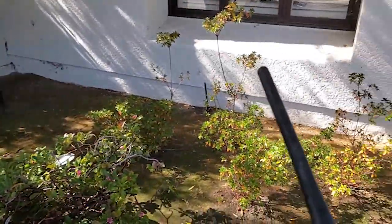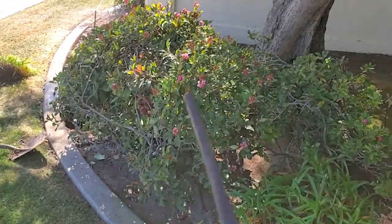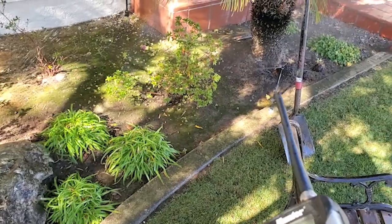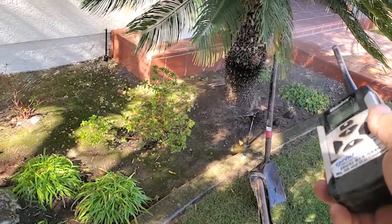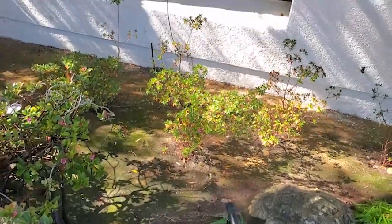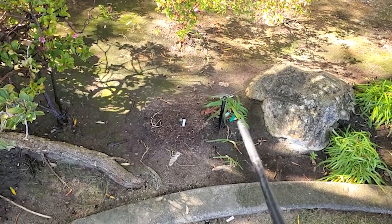Okay, so I turned off the nozzles on these back here because they really aren't needed. This tree's getting plenty of water from the one behind it, from the lawn, and from this one. So this one had a 15-foot nozzle on it, as did that one over there. I changed this one to an 8-footer, and I changed that to an 8-footer because it was a 10-footer, and obviously even an 8-footer is too much, but it needed to reach over to the porch over there. So now we've got better water pressure in here, and we don't have to worry about this hitting the window, because the 15-footer's trajectory was getting the window wet, and this is a flat spray being an 8-footer.